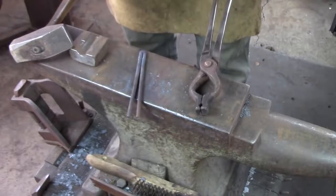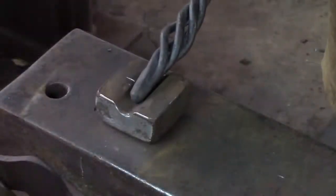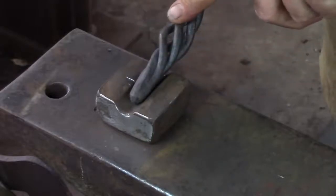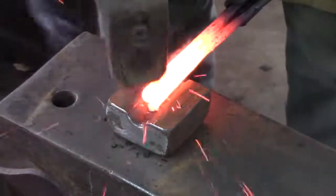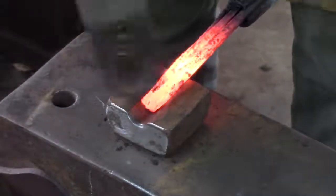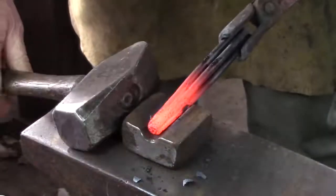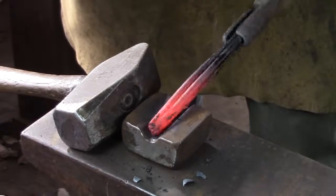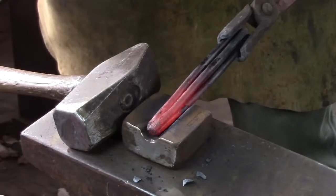The open end is going to be resting on the closed end of the other staple when we make the basket weld. I like to weld in a half-round bottom swage — in this case, three-quarter half-round — as it contains the various pieces and constrains them, stopping anything from spreading out during the weld. As soon as I'm sure of my weld, I turn it so I'm forging on the flats presented by the round bar. This will give the scarf of the shaft somewhere to lay when we do our drop-tongue weld.